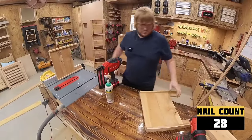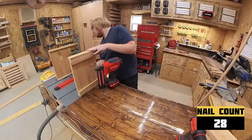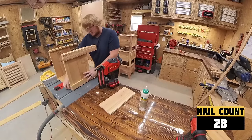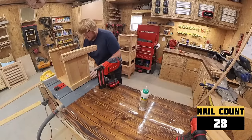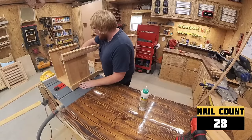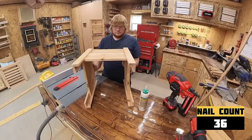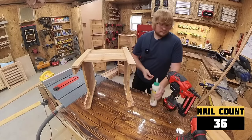I use my table saw fence to hold one side up while I apply the wood glue. The fence also comes in handy when I push the sides together. Apply some glue on the lip and align your short boards with the top of the box. I have a few boxes where the pickets were not the same width and one side was longer than the other, but this is less noticeable with how the legs wrap around. Again, four nails in each side — they are less noticeable since they are on the inside of the box. Flip it over and repeat. If you have a board that is cupped pretty bad, just note that most of the glue is going to leak out, so try to target the area where your boards will make contact.